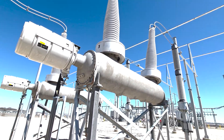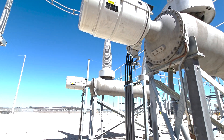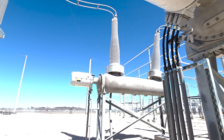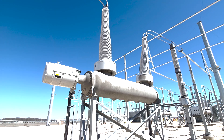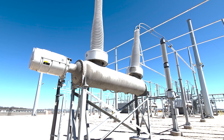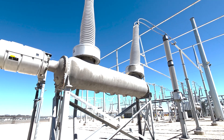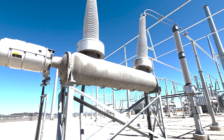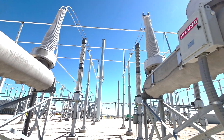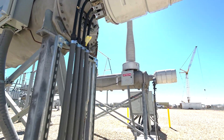The gas is apparently eco-friendly. The C4FN gas in the atmosphere will eventually break down — it's got about a 30-year life before the chemical compounds break down. SF6 gas, which is not eco-friendly, lasts for something like three to eight thousand years in the atmosphere, which is crazy. This gas does break down fast, and even if it is in the atmosphere it's apparently not harmful. So that is why they're going with these.